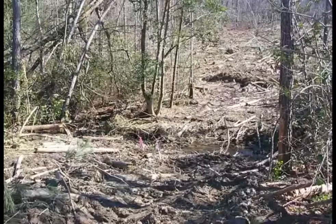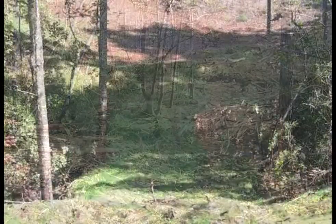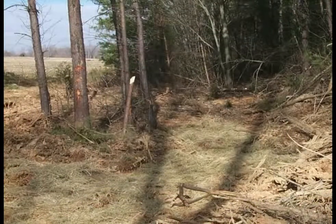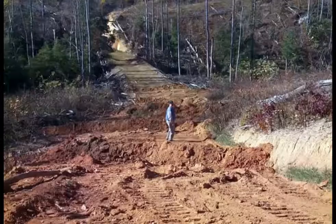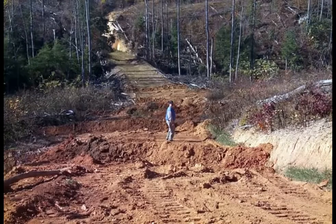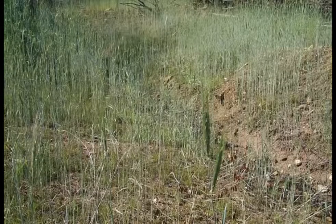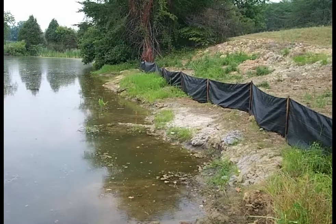Don't forget to stabilize the approach areas to the bridge mat crossing on both sides. Any disturbed or bare soil in the first 50 to 100 feet of the bridge mat approach should be stabilized. This may include such tasks as building water bars or sediment pits, creating brush piles to block any runoff from flowing into the stream, seeding over skid trails, roads, and approach areas, and installing silt fences or hay bales.